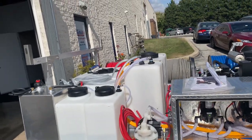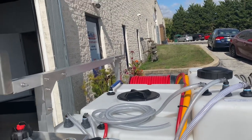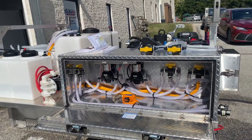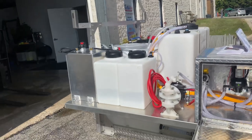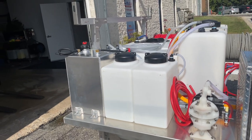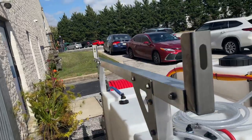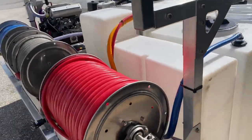Now we have modified this tank here. We have a bleach vent installed here. So this one hose is just a vent line that's going to be run somewhere on the truck to vent that tank out from the bleach since we are not removing the lids. Then we just have a series of ball valves that operate with the 12-volt system for rinsing and filling. Next we have our 1/2 inch all flow pump. 2 7-gallon soap tanks that are going to work with that proportioner, and then our 11-gallon fuel tank. This skid has the 270-gallon water tank, and then we have a 100-gallon tank for our bleach.